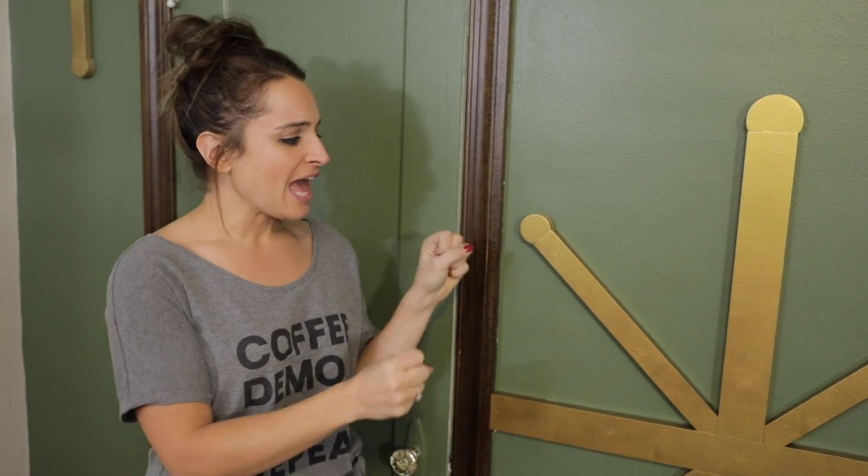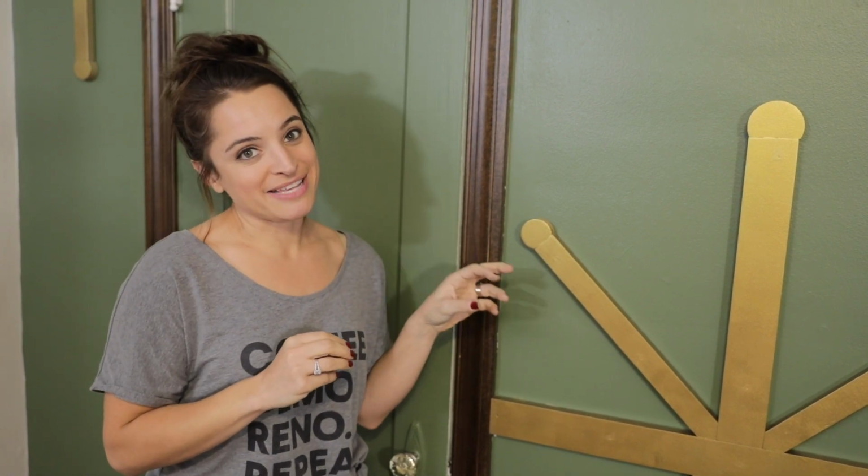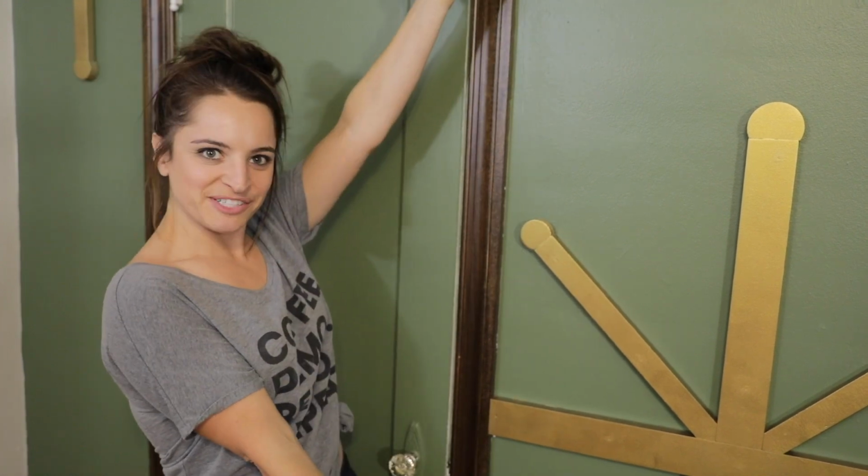It's so pretty. Then for this situation, Valspar has this architectural line of paint. You can get different textures. You can do plaster. We decided to use their Brilliant Metal line, which is baller. You do a base coat first. We did 2 coats of that, and then you could either spray on the top coat, which is metallic-y, or if you use a thinner nap, a 1/4-inch nap, it'll make it really smooth and shiny and amazing and pretty, and get you this situation.